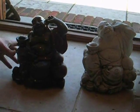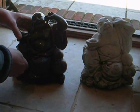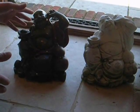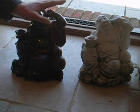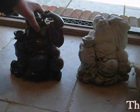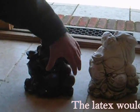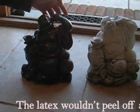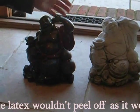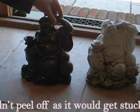So if you could imagine peeling this, putting more pressure to get it over certain things, it does stretch, and it can be a little difficult to get off. The next thing you have got is holes. As I said earlier, you need to pull it right off. So if I left this hole, there'd be a massive gaping hole when I'm pouring whatever medium you choose.